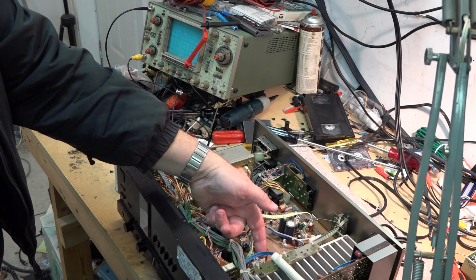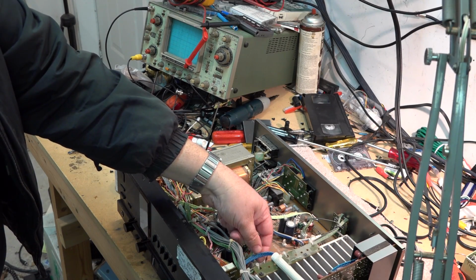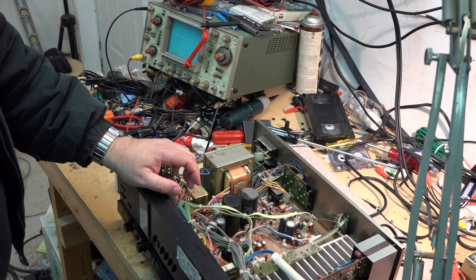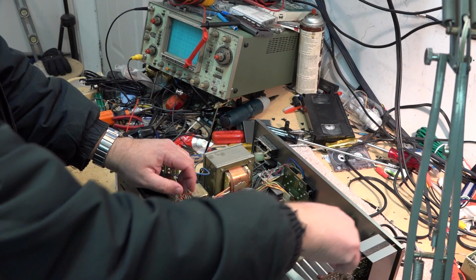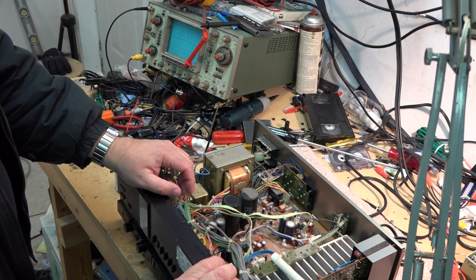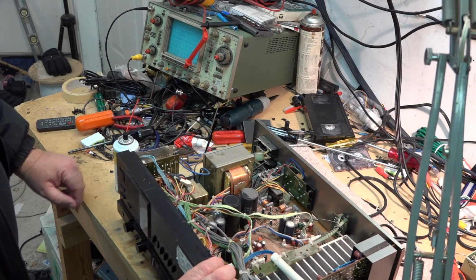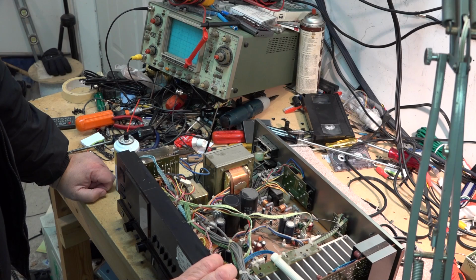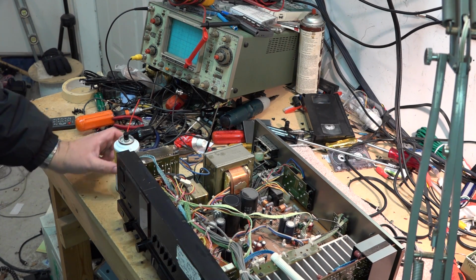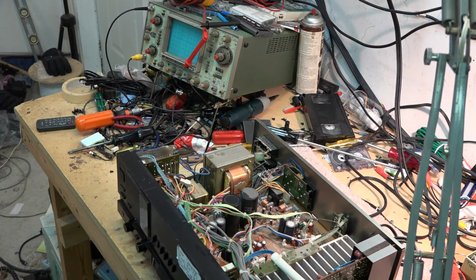It's actually switched through this long cable, which has a metal band in it that when you push it back and forth, it slides a metal band back and forth inside here to actually activate the slide switch that's underneath this cover. The reason it's shielded is to shield it from hum. I think my switches are probably pretty clean now, so we're going to hook this thing up and we're going to see how it sounds.